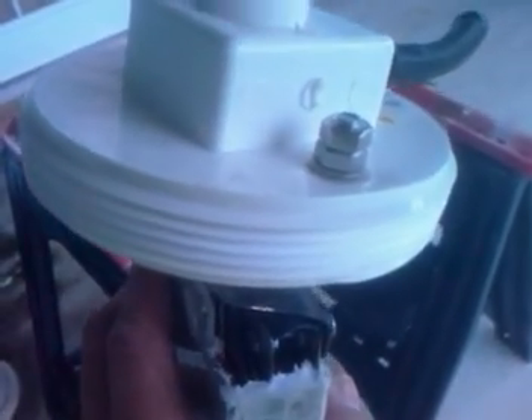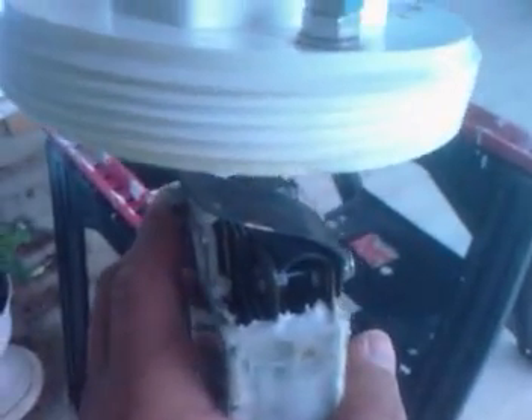But in the top cap, I'm still having the same problem. This is on the negative side. I got a clue as to me having the same problem again by looking at the top cap and seeing that the bolt started sinking down a little bit. I'm going to try putting a fender washer in there next time to help keep that up a little bit higher. Nothing really on the positive side — it's looking really good. As you can see, it's still well spaced away from the top of the top cap, but it's just on the negative side.